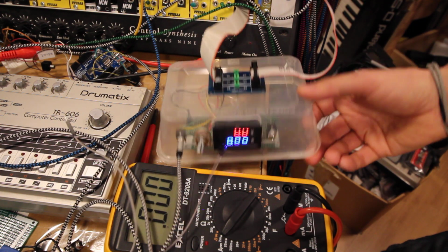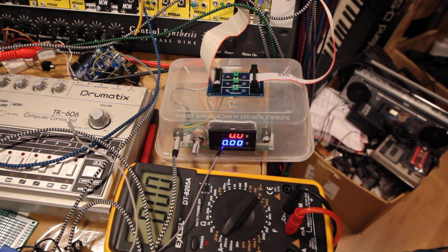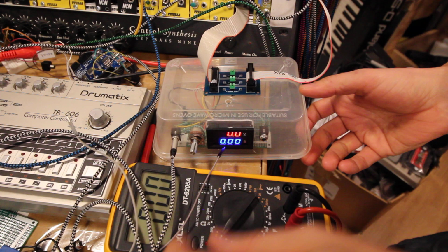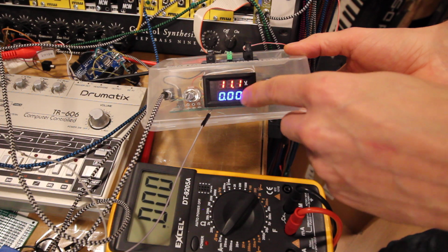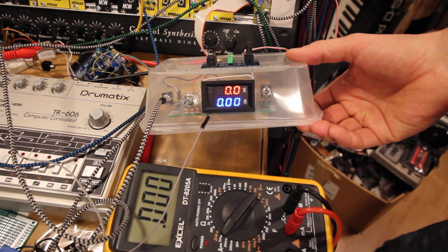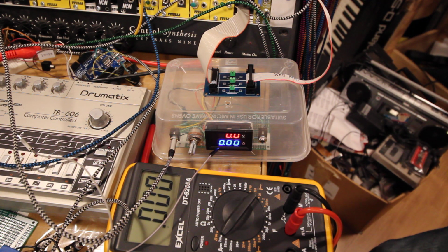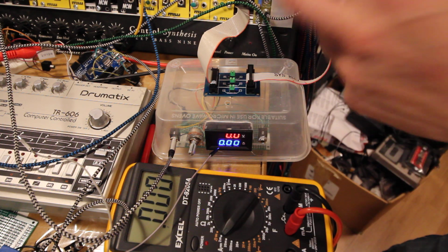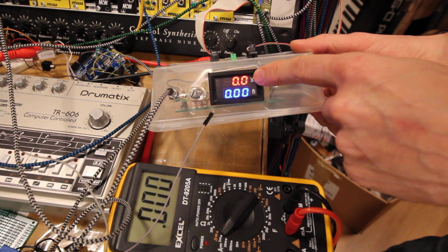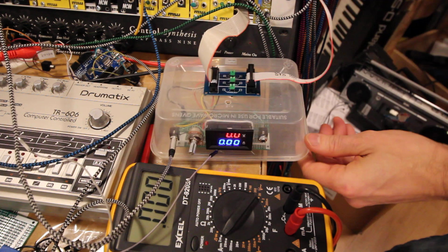I've missed having this one because I do find that in my particular modular right now I have a mismatch with voltages. The hex oscillator is really high output, and it's a bit too high for many things. But then I have other modules that don't have enough input, so I need to fix that, because I've built the input to get these really high 11 volt inputs to work, so I need to fix that with comparators and stuff like that. So good to know this works.